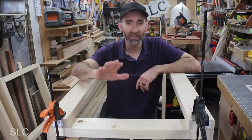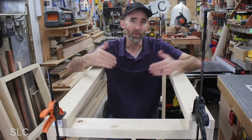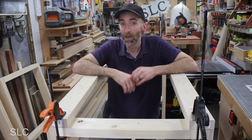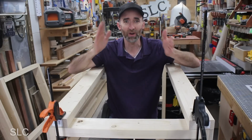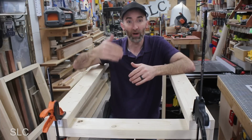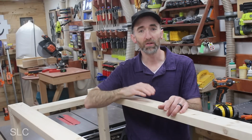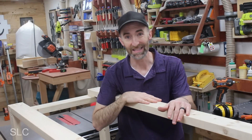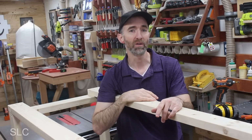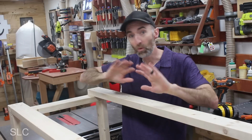At this point, I'm going to attach the top and the bottom together at the same time. And yes, that will make it a little bit more difficult to get the middle shelves in place. I'll probably have to tap them in with a mallet. But that's okay. By doing this, it's going to secure everything so it stays nice and square and rigid, so I don't get it out of whack in the process of trying to install one of the lower shelves and it just messes it up. To install the other 2 shelves, at least to get them started, I'm going to leave this on its side. It'll be a lot easier to get those initial screws in place without it trying to move around a lot.